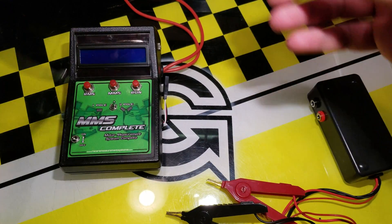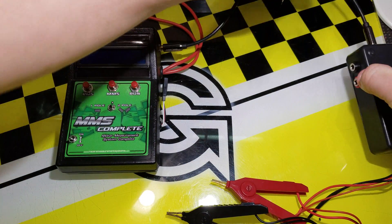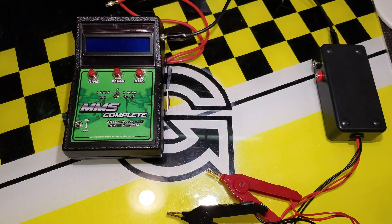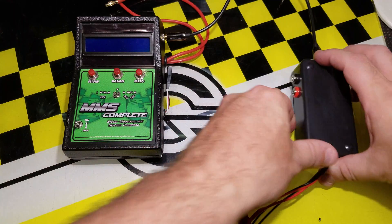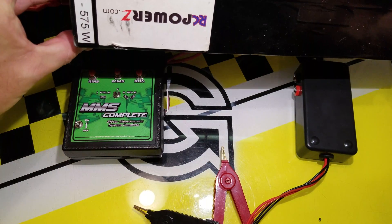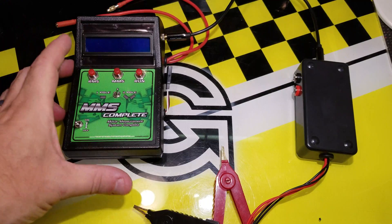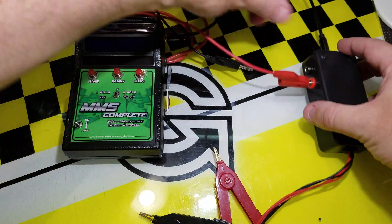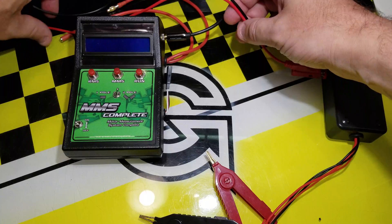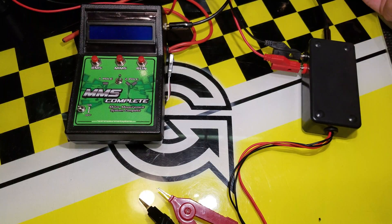To connect it up there are quite a few wires involved. First, we connect the base unit to the resistance attachment by way of a small headphone cable. The next part requires additional power — at least a 12-volt, 2-amp power supply. I'm going to use my bench power supply, which is 12 volts at 575 watts, about 48 amps — well more than enough. You just connect that in here; right now the power supply is off, but it does create quite a few wires.